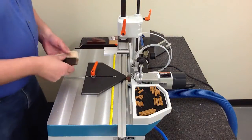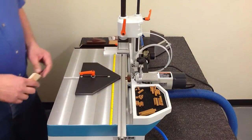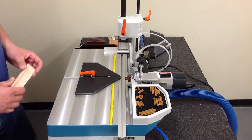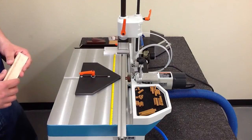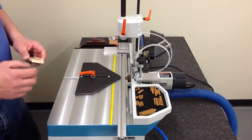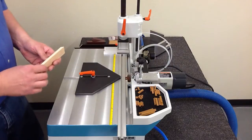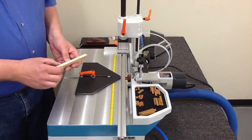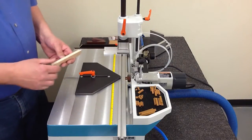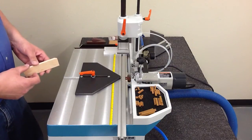Start here. The machine we're using is the Hoffmann MU2P dovetail routing machine. We have it equipped with a W-1 oversized router bit. Oversized means that the bit is slightly larger in diameter than the standard bit, and what that does is it reduces the sideways pressure here when you insert the keys. So on thin molding, this one here for example is about 5/16 of an inch thick. Between 5/16, 3/8 up to about 1/2 inch, you want to use an oversized bit. Above that you can go for standard bit.